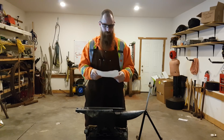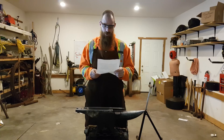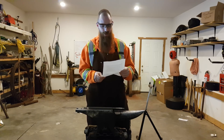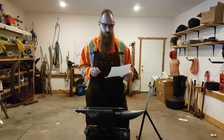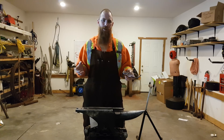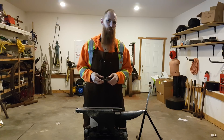What is annealing? Annealing, in metallurgy and metal science, is a heat treatment that alters the physical and sometimes chemical properties of a material to increase its ductility and reduce its hardness. This is the thing we're most after — reducing its hardness — because it makes it more workable. Long story short, we take some metal, we heat it up to non-magnetic, we hold it there for a little bit, and then we cool it.